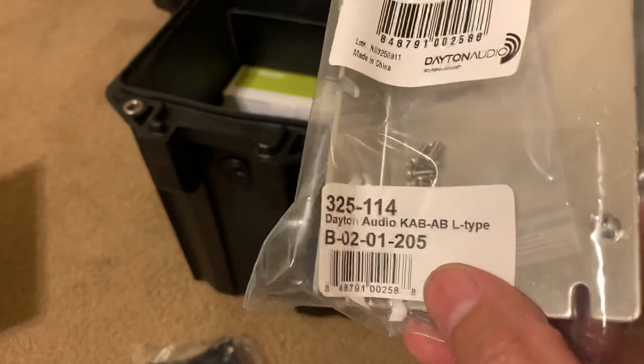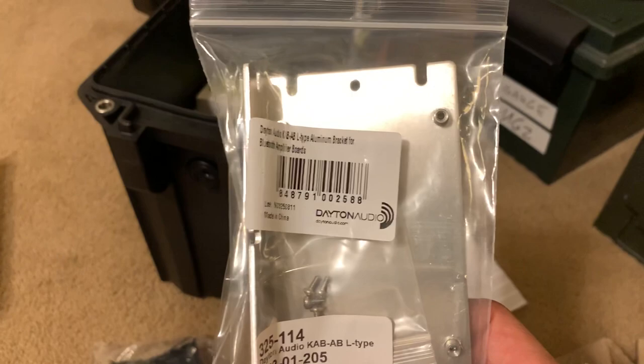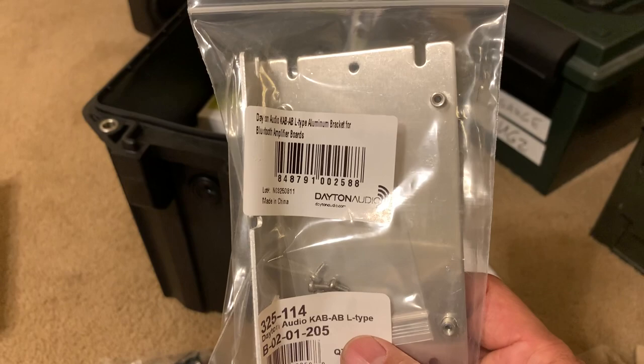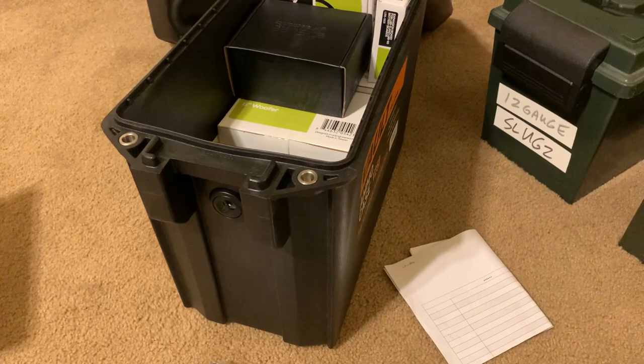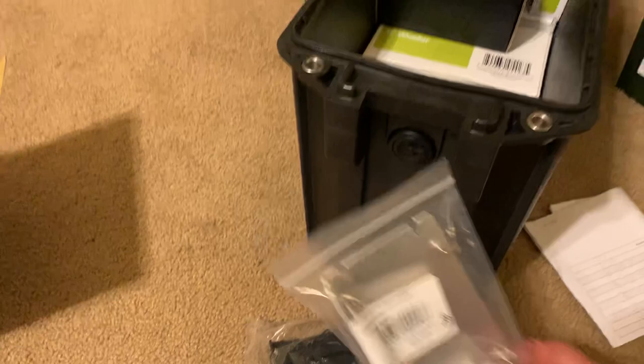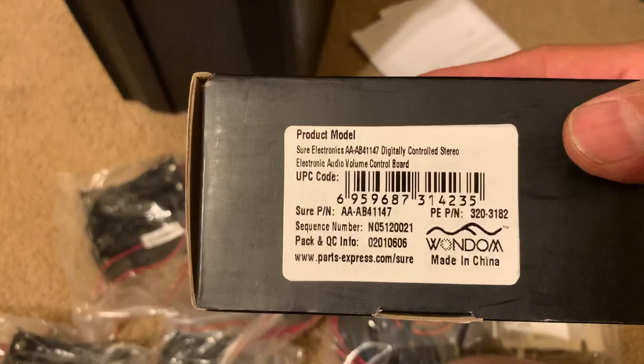Here is the part number. Basically, this is going to mount both the Jab 2 and the Jab 3. The Jab 2 is the Bluetooth 4.0, 50-watt per channel amp board. And then the Jab 3 is also 50-watt per channel, two channels, but it has the ADAU-1701 DSP chip on there and they talk together. This little kit allows me to just stack them right on top of each other. Most likely I would just have it mounted on the inside with batteries on the bottom.